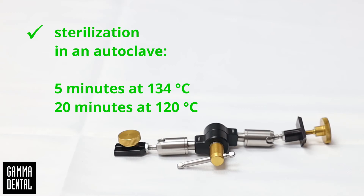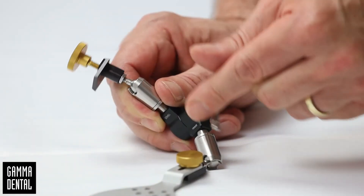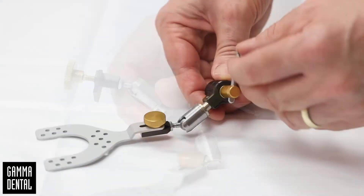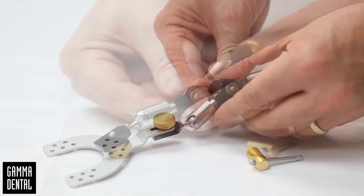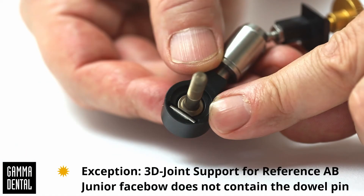Now let's talk about issues of handling and proper usage. When opening the support, do not open more than 1-2 full turns — even 1 full turn is sufficient. With further opening, the dowel pin inside the housing, which serves as an anti-twist device, would slip out of position, and the fixation would then no longer be given.